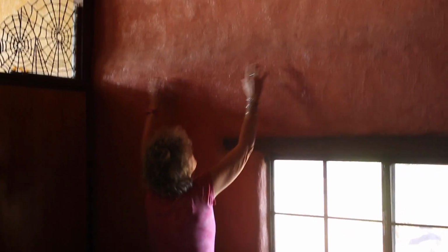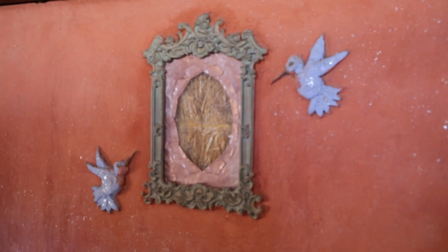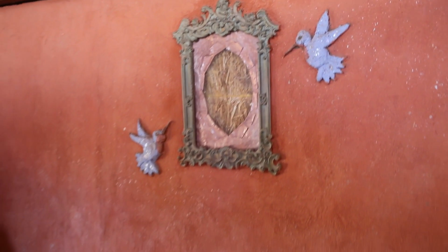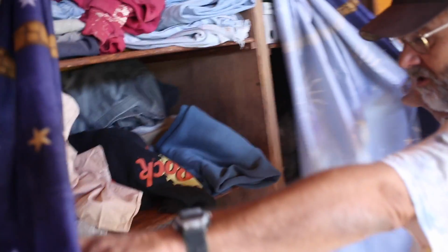And here you can really see where our slip straw wall starts from here up. It's solid cob, 16 inches at the bottom, tapering up to this point of 12 inches thick. You can see our truth window over there showing the straw bale wall. That's our north wall, and that's because it's an insulating wall. Sun would never come in, so we don't put any windows on that wall. And then this back area is just basically storage.